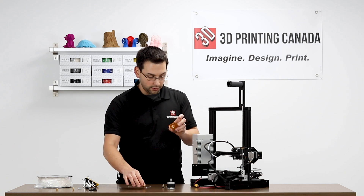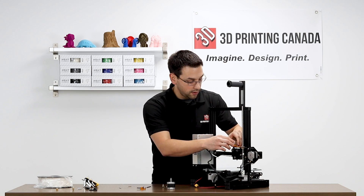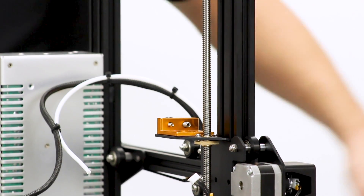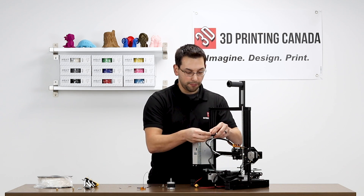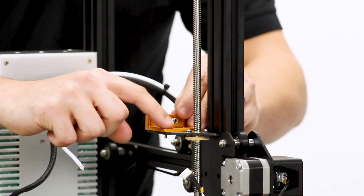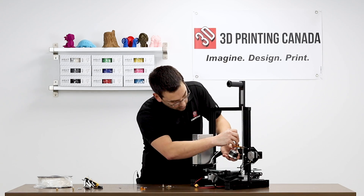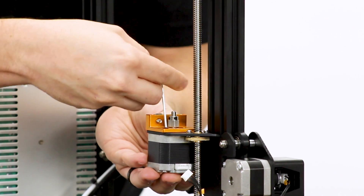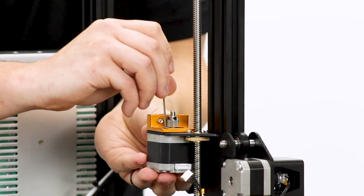Now there are really just two pieces here to bolt on. The first piece is going to go this way — this is where the filament is coming out, and this is where the PTFE is going to plug in. We're going to reuse one of the screws from the original assembly — the screw from this hole here, which is not the pivot point of the lever — and use it in this little recessed hole on the new bracket, just to hold the extruder motor up in the assembly. I'm making sure the motor is going back on with the cable coming out the side.